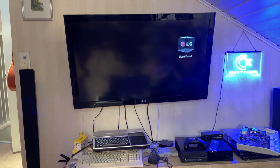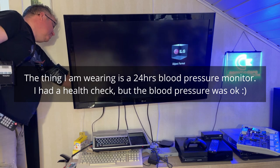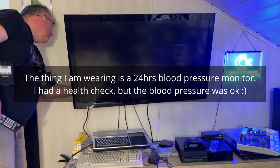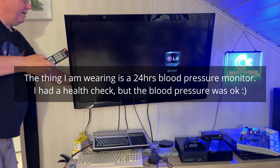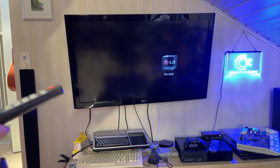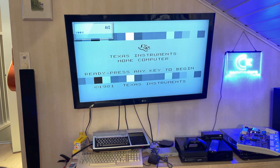The thing is, if I connect the luma signal to the regular composite video input, then I actually get a decent picture, of course without the colors.